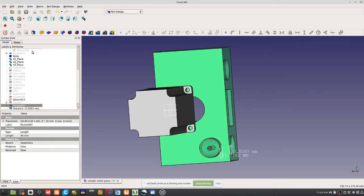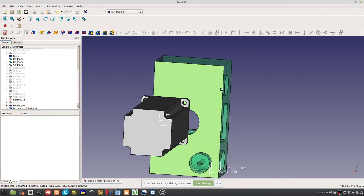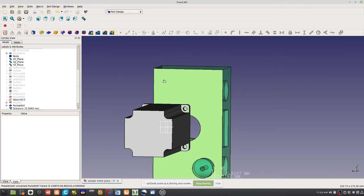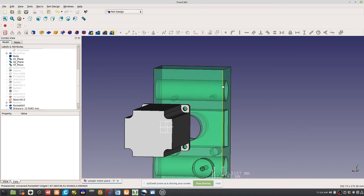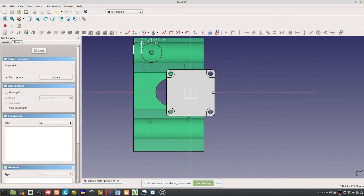Let's talk about the geometry of how you interconnect at right angles, horizontal or vertical. What suffices is to have a bunch of through holes in a regular grid pattern. Let's call it 1 inch, just for America here. So let's do a bunch of holes at 1 inch spacing for mounting. Here we have some space available, so if we had to mount to a frame, the rod is not in the way.